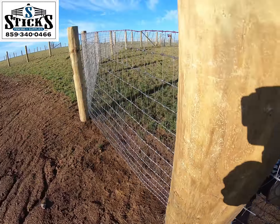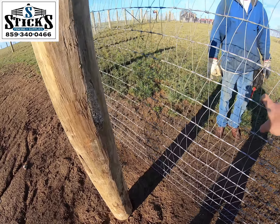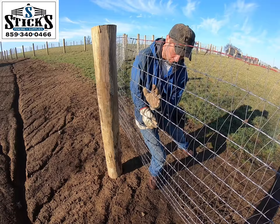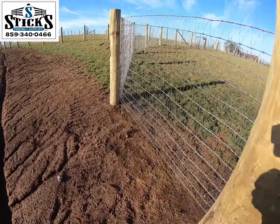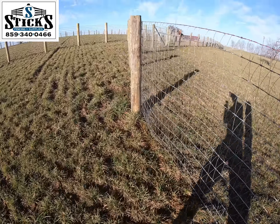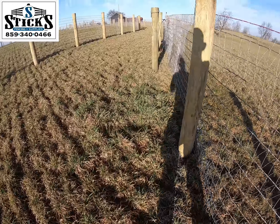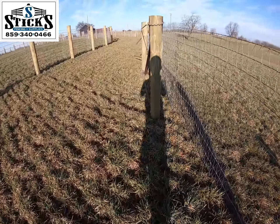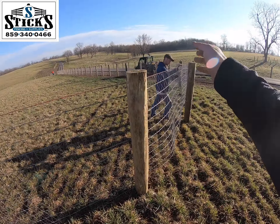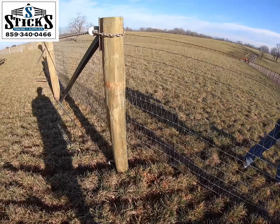Chicken, I think it's probably going to be tight enough. You can tell how tight it's going to get when you pull back — put your body weight into it, Chicken. So we're going to walk all the way back up here to the start of our curve and we're going to work toward our next pull point. The reason we do that is when the wire is too tight at one of the posts at the far end of your curve, we just let back on our stretcher bar.